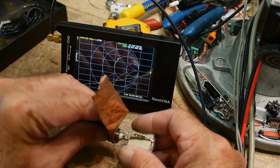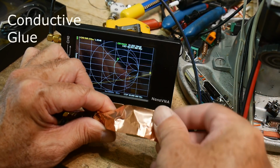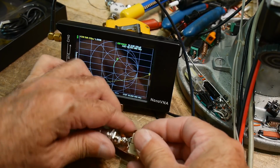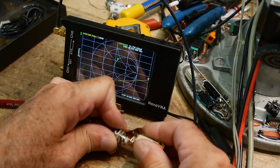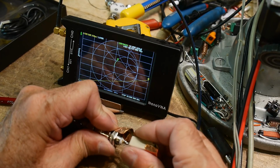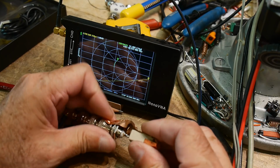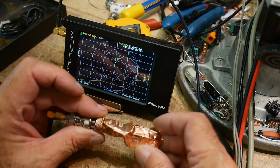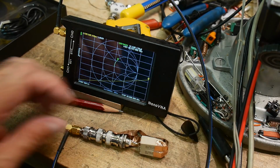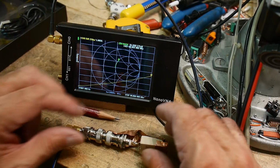We're going to put it on the BNC over here. It has conductive tape, and so I'm going to put conductive tape on it. So why would this change? Well, take a look. It's a much wider area, and it gives a path for the RF instead of that tiny little inductor. Now you've got the big fat thing, and it has very little inductance, right? And so look what we've gone to. Now we're down to 1.8 with that change.